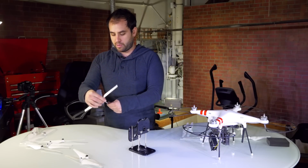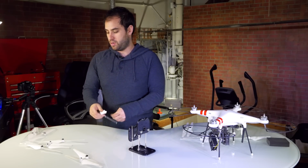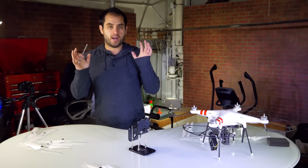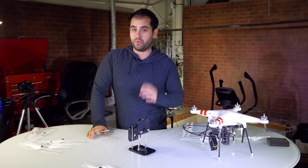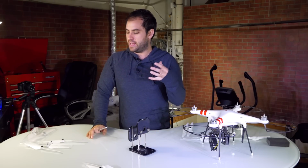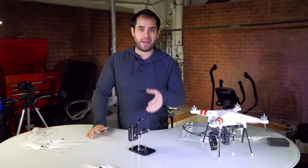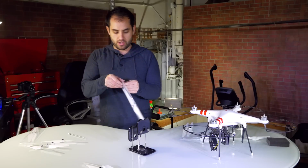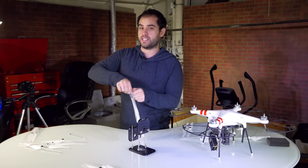They all need a little bit of balancing, but they're much, much better off than these were out of the bag. So that's partially why people were having some problems with these, but I don't think that's the main problem. What I discovered is actually it's not the balancing of the blades that's the problem. It's actually the hubs, and not even the balance of the hubs. It's the actual inside of the hubs that is the big problem. Let me show you a brand new set, because I'm sure these will have the same problem as well.